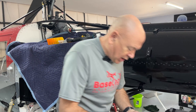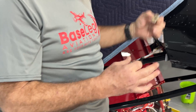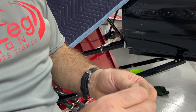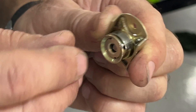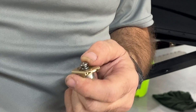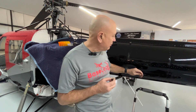The Skybolt fasteners versus the cam locks — you can see the Skybolt, they're infinitely adjustable. What that means is once this is all mounted in your fastener from outside, whatever you're holding on — in this case on the Hummingbird helicopter, we're holding the cowlings on — you just put this in from the outside, put your screwdriver in there and tighten it. You just turn like a screwdriver till you got the exact depth you want. Then if you look closely on the backside, see that little pin? Once you get it where you want it, you just pull that pin out and they lock in place. Unlike cam locks that come in specific setting lengths — dash 2, 3, 4, et cetera — you always end up with a cam lock or two that's just somewhat in between, especially when working with things like fiberglass against metal, because the carbon fiber is just not a consistent depth across its entire range. So the Skybolt makes for a much neater installation.